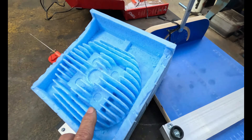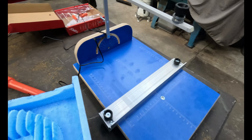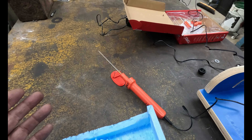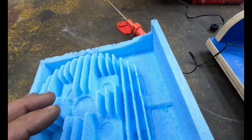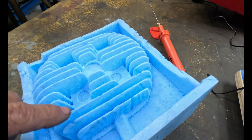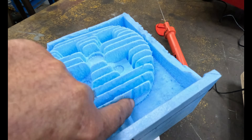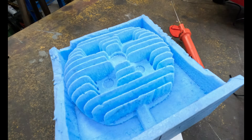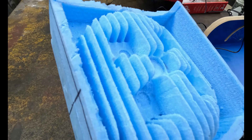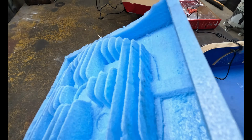But for a test piece, this will be absolutely fine. I've got my hot wire cutter — it's just a hot wire thing for cutting and working with foam. What I'm actually doing is running that wire over the furry bits through all the fins. You can see here I pressed a little bit too hard, but I'm not too bent out of shape. The next one we machine up will be pretty good off the tool, but we'll progress this, and hopefully I'll have a go at casting this tomorrow.